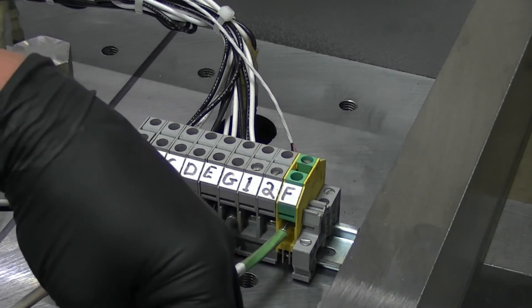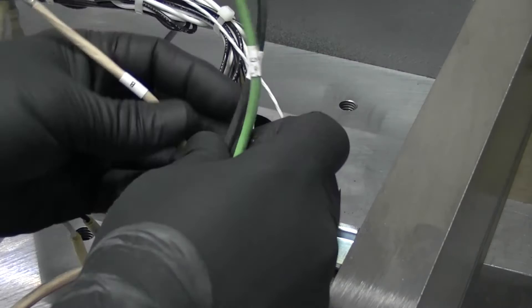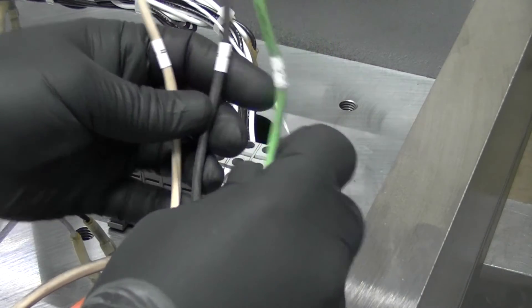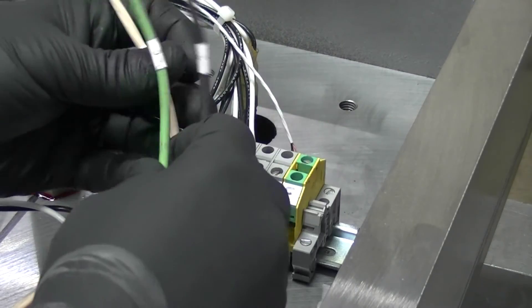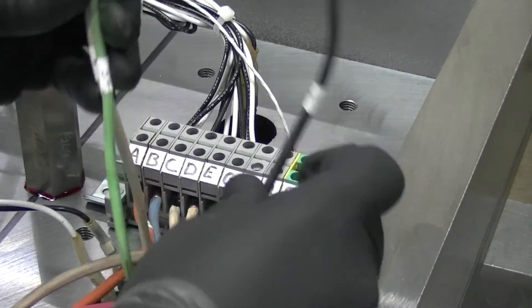Next, let's take a look at your RTD power cable. There are three wires on this cable: a black, a white, and a green shielded wire. The green wire is not a ground wire — installing this wire to ground can cause damage to your RTD probe.